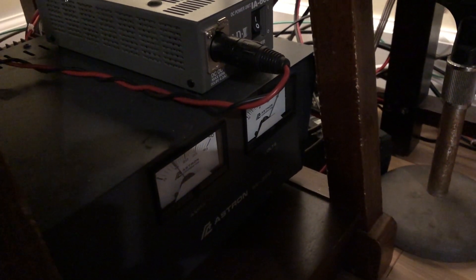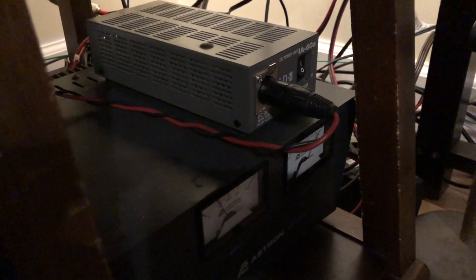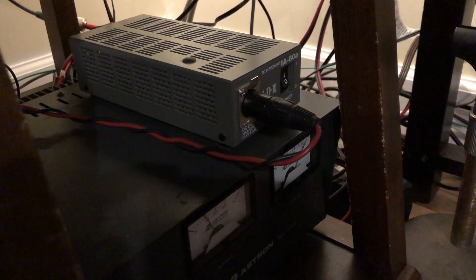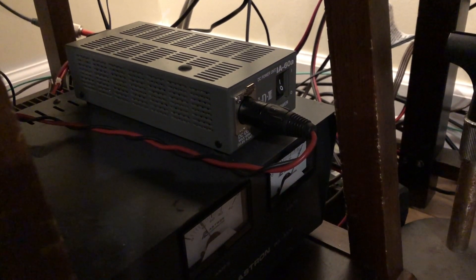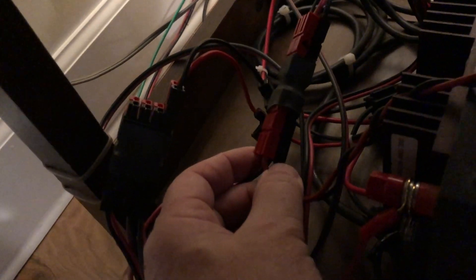Here's the DC power below the desk — Astron power supply RS35M that operates the FTD-X3000 and also operates the Kenwood VHF UHF. They both draw a lot of current but I'm not transmitting on both at the same time, so they can co-mingle and coexist on that power supply. The top one is a little switching supply for auxiliary devices in the shack. Behind the power supplies for DC distribution I'm using these — Quicksilver Radio makes these, it's like a little Anderson power block. I take one feed off the power supply and run it into this block, then just connect the radios to it. One is an eight-port and here's a four-port. They work great — very reliable, and I have one port on each going to that little DC power meter you saw up top.